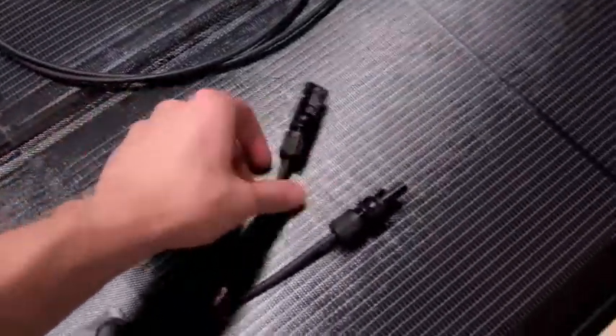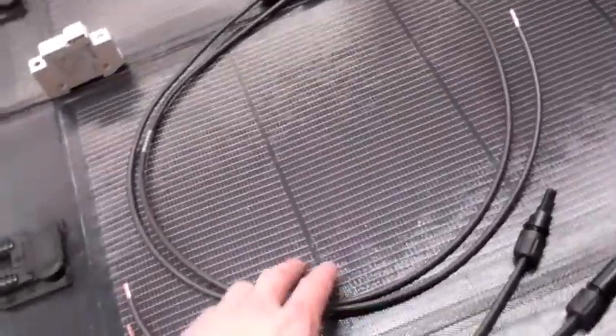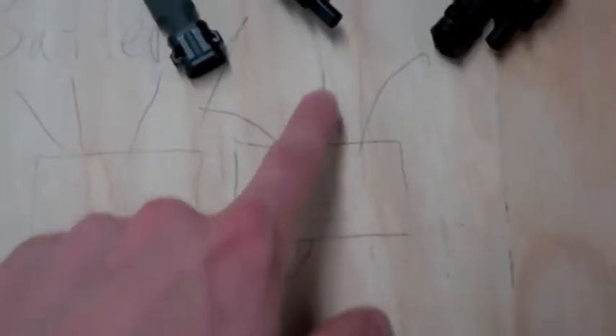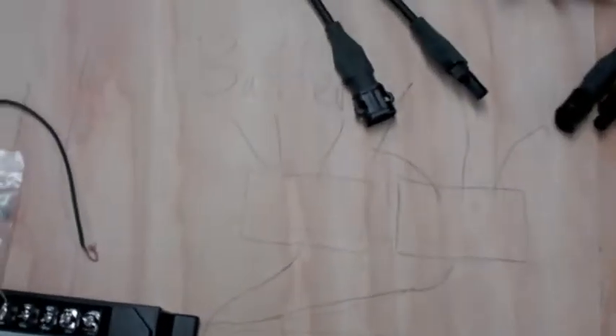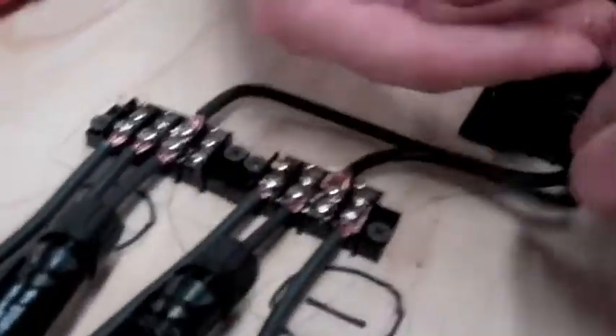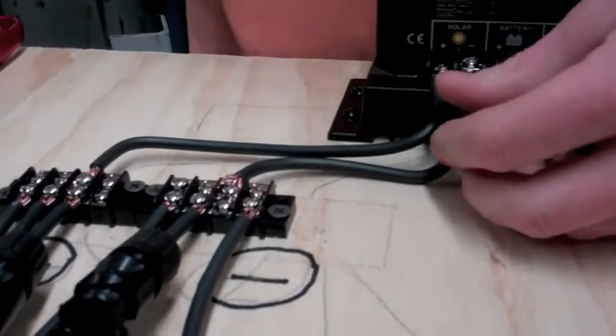Show the final result. So what do we have? We just made these two short wires, a little bit longer, and these for the furthest distance — but we're going to cut them. We're going to put these little junction pieces in as well, where three of the wires come together and they are parallel coupled. They attach to the MPPT. The negative side of the three panels connects to the MPPT — the maximum power point tracker — which will allow us to get maximum efficiency out of these panels.